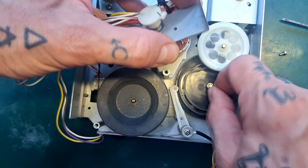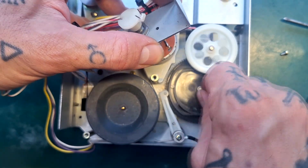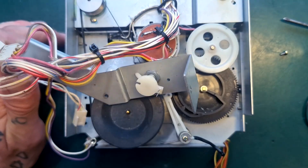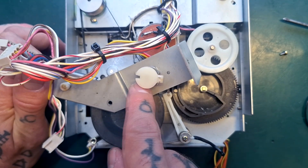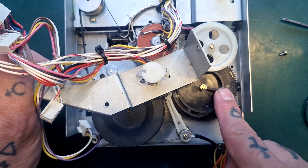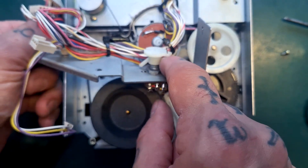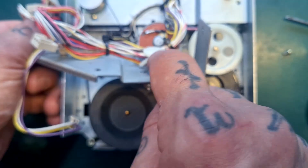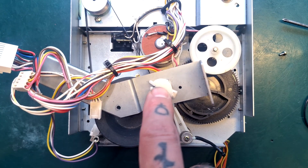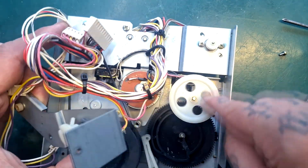There's this white cap on the potentiometer. Under normal conditions that would just be solid white plastic, and it grips this part of the black gear via that ridge. In order for that mechanism to work, it's essential that the white plastic part creates a solid interface between this potentiometer and the black gear below it, and also that the relationship between this white plastic part and the potentiometer is correct.